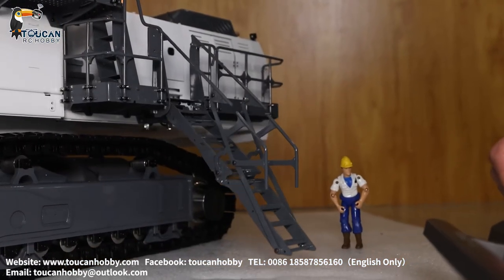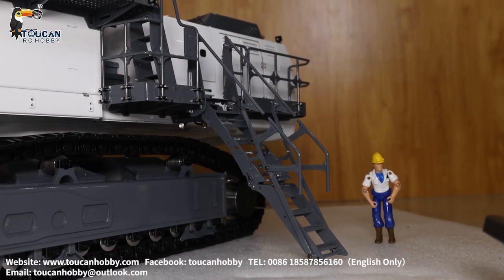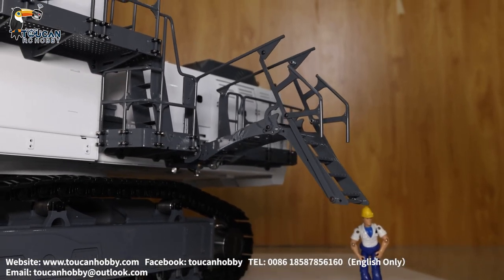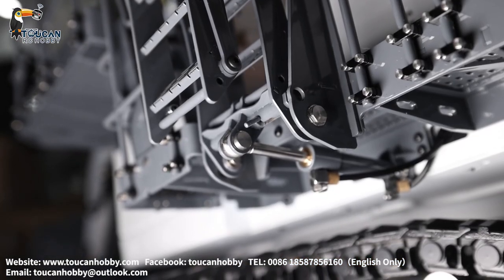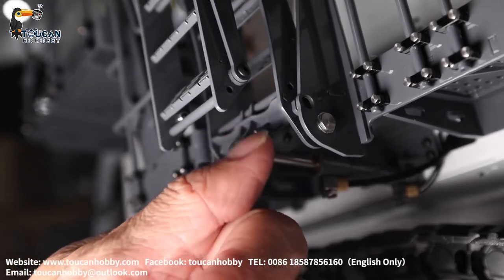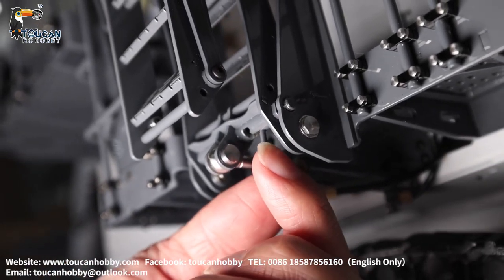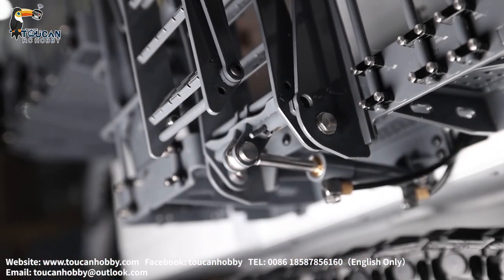Put it down — so a man can climb down for operation, and put it back. That's a slow motion. Speed up. Here that's the cylinder for controlling the ladder. And here have a manual lock. So now it is unlocked. For locking it, push it down — it's locked. And before your operation, unlock the ladder. Don't damage the cylinder. Unlock. So now you can operate.